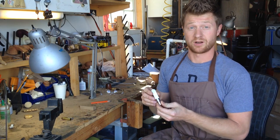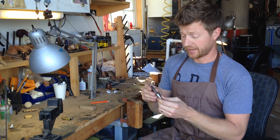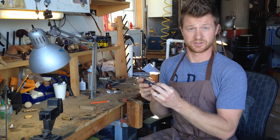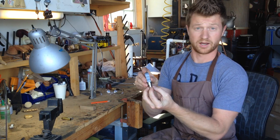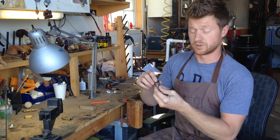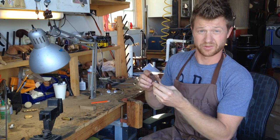These bits cut really well. They make a really nice smooth chamber on the inside, and they're not hardened, so that makes it easier for the headstock jaws on your lathe to grip the shaft. It also makes it very easy to hone and refine the edge if you need to sharpen this tool with a diamond file.